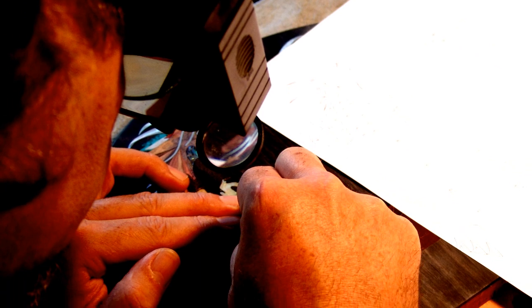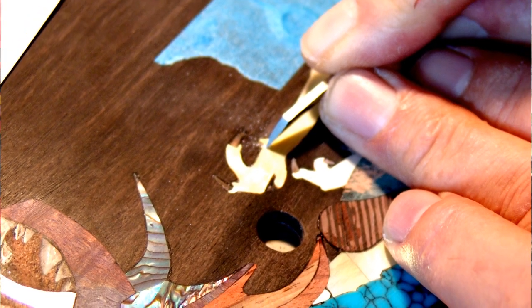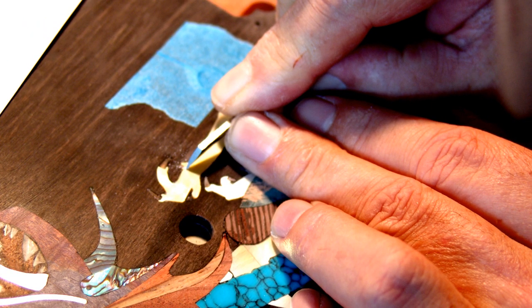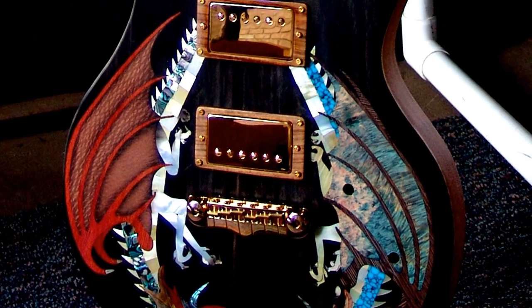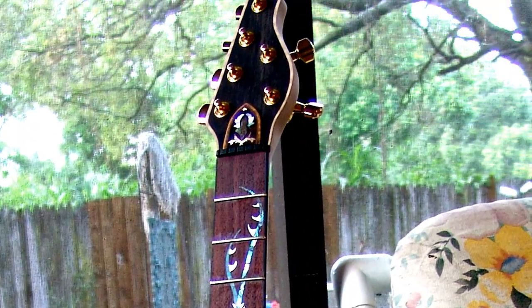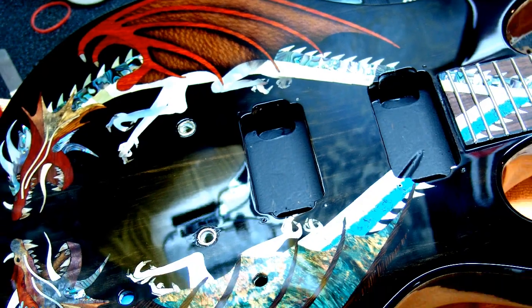Finally Virgil etched lines into the mother of pearl. Etching into mother of pearl is nerve-wracking — if you mess up with that really sharp blade, there's no eraser. You'd have to take out the whole inlaid piece by recutting, setting you back hours or days. It was finally time to send it off to Mo Colors to get its poly finish. Mo had tons of guitars to finish, so I used that time to start designing another guitar.